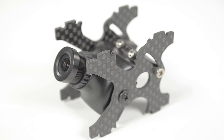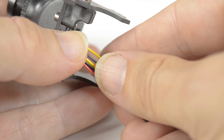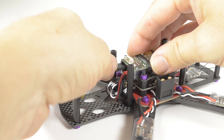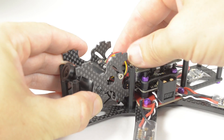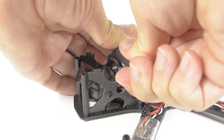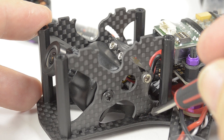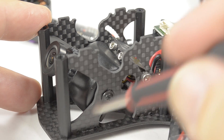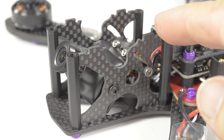Take your camera assembly from the previous steps and insert the lead securely. Coil the lead to take up the slack — I find it easiest to plug in before the camera goes in. Make sure it's pressed in securely, keeping the coil in the wire and the wires out of the way. Drop the assembly into place, making sure each tab is pushed down into the frame. The box section is designed to be tight to add strength, bracing against the carbon plate, the standoff, and the top plate — so there's no room for movement and it's braced in both directions. Don't tighten the tilt screws on the camera until after the top plate is assembled and the tabs are locked in.